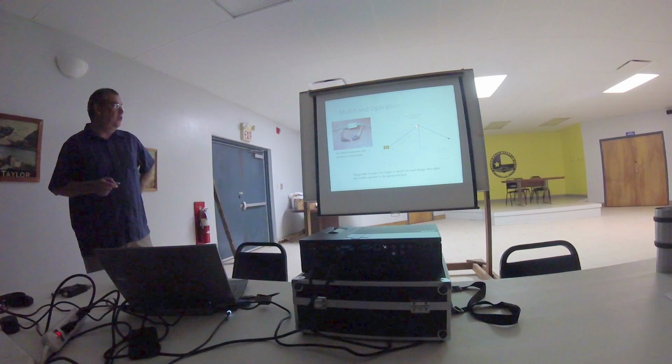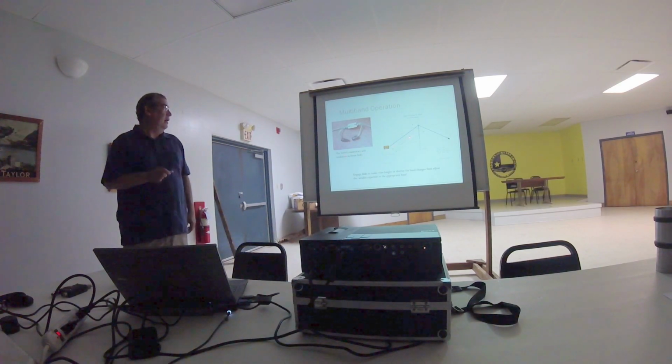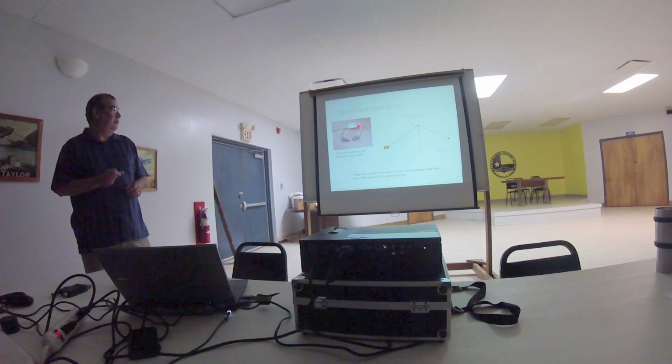But if I'm going to run at 20, I can open up this link here, and now this is the only part of the wire that's actually going to be resonant. And likewise, if I want to run at 15, I'd open up this link here. So essentially, by opening those links and then changing my capacitor value, I can get this antenna to work multiband also without a tuner. So it's fairly straightforward to be able to set that up.